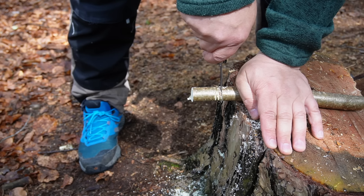The last trick is a very quick and easy one — it's about how you can reduce the friction of the saw blade in the wood. For that, you need an old candle. All you have to do is put some wax on both sides of the wood saw, and it is crazy how much this wax reduces the friction. I saw this trick a few weeks ago on a video from my friend Joe Price — he is a fantastic bushcrafter. I was really surprised how well this trick works, at least for a short time. It's not a long-term solution, but for a short time it reduces the friction enormously. The link to Joe's YouTube channel is here and in the description box below.